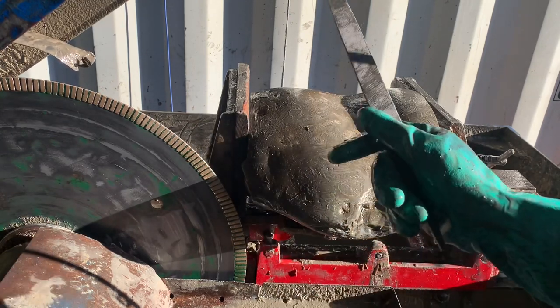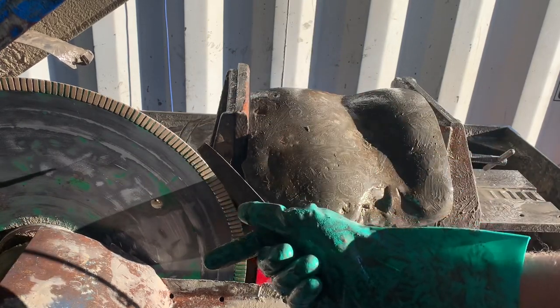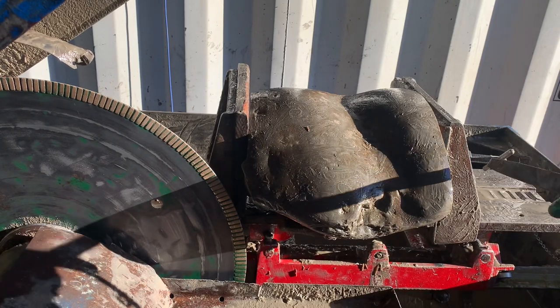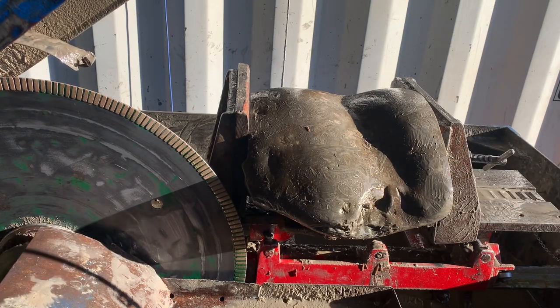So taking care to properly clamp, keep your blade sharpened, keep your oil clean, don't run into the flange washer. And then the last thing is don't over tighten this back here. You can break your grip system with too much pressure.